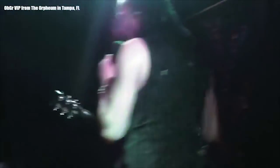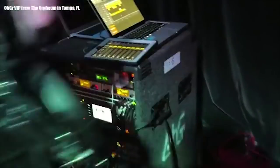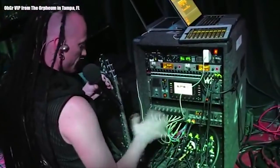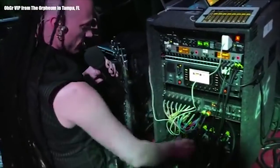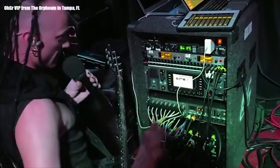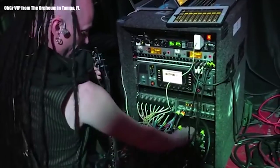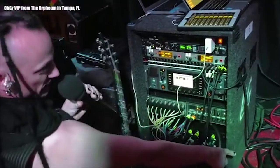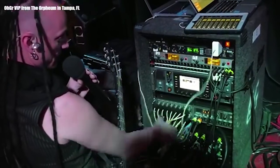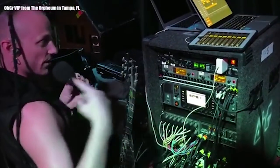This will be the real tech-heavy stuff on the tour — this is all my equipment. I designed this monitoring system for the tour. We have a couple of rack splitter snakes here. Everything onstage — drums, vocal microphones, synths — absolutely everything plugs into the front of this splitter snake. One side goes to front of house in the analog realm, and the other side plugs into the back of this X32 rack, so we're all mixing our own in-ears.